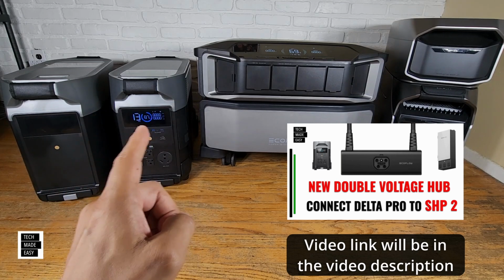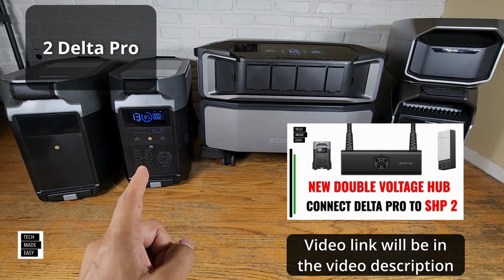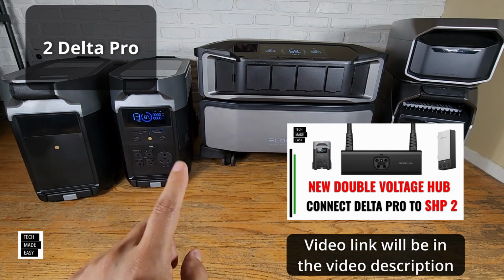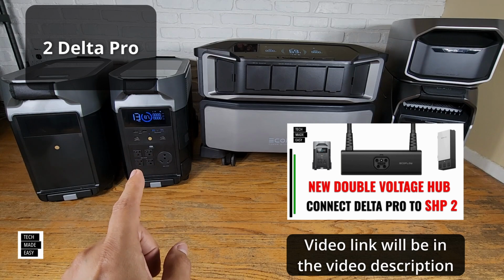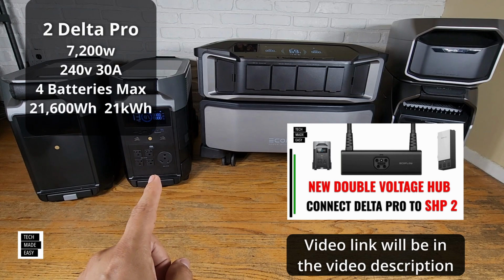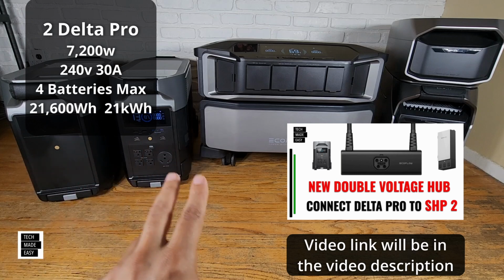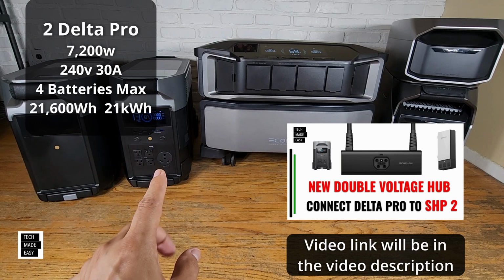And so you can, again, take 2 Delta Pros and connect them to this new double voltage hub. It's called the input-output double voltage hub, just so you'll know. That basically allows you to connect to the Smart Home Panel 2, with 7,200 watts, 240 volt, 30 amp. Again, you can have 2 batteries on each Delta Pro for 21,600 watt hours. All right.